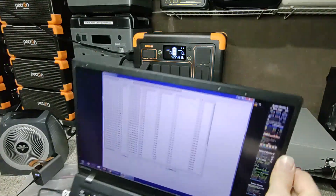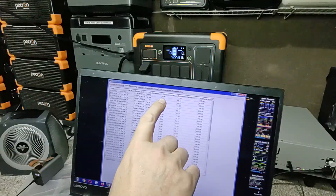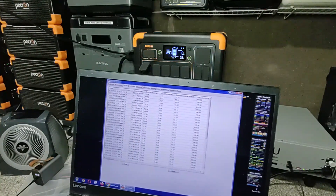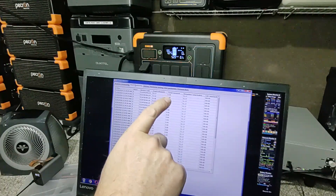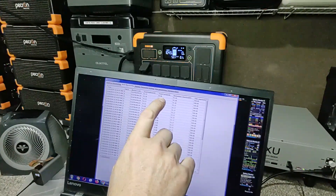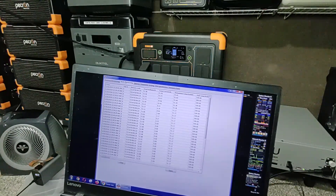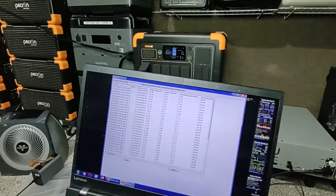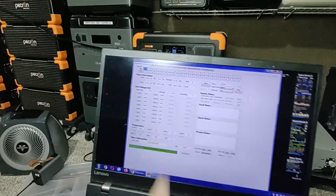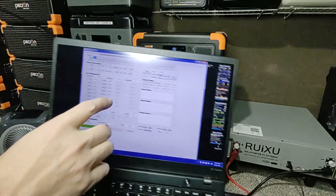On the real-time monitoring page — it updates every two seconds, configurable to any interval — you can see the current is zero, meaning the system isn't perfectly balanced yet but will equalize if left alone. When I turn the charger back on, the amps start rising: 0.35, 0.27, 2.68, 4.44, climbing up to 10.43, 11.07, 11.15, settling at about 11 amps going into the server rack battery.